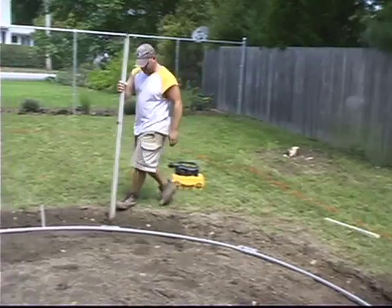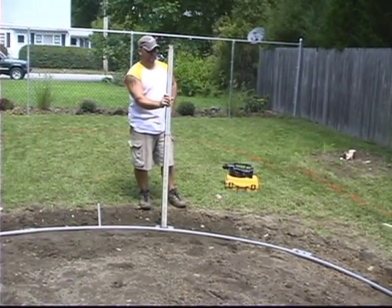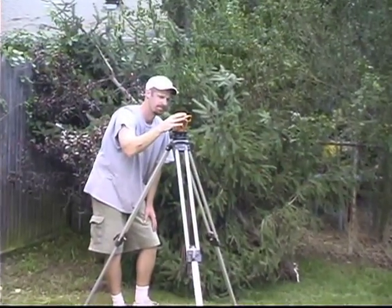Level each of the bottom plates or bottom cuffs. All of these parts should be within a ½ inch of each other and the tops of the strap end channels.